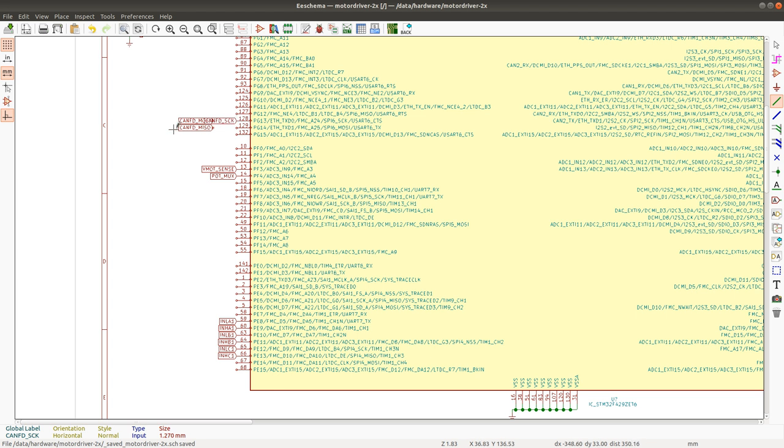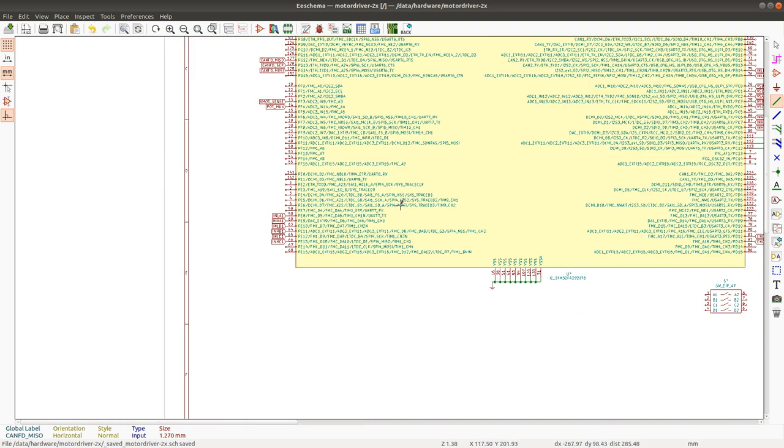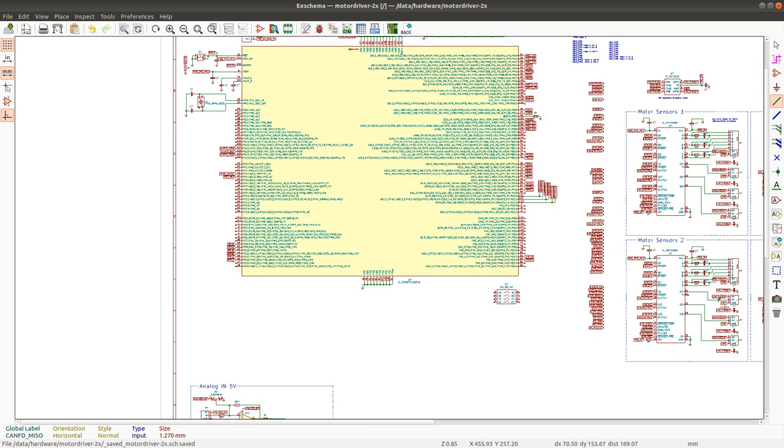It's going to be connected to the clock there and MOSI there. And MISO there. Putting this in a separate SPI interface is a good idea, so that it doesn't have to wait for any other device. But SPI4, is SPI4 available? Yes, it's actually available here. That's good. So these pins are taken, but it's available there, which is nice.